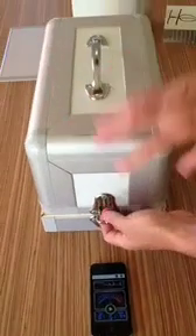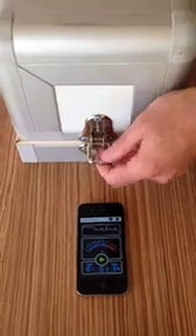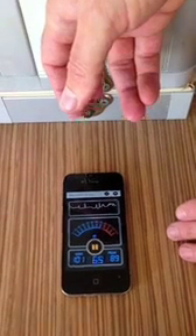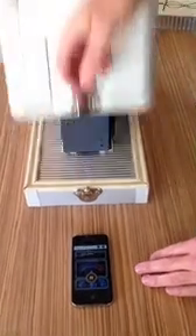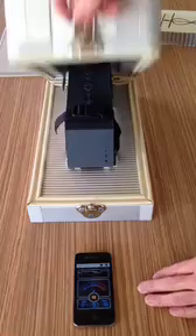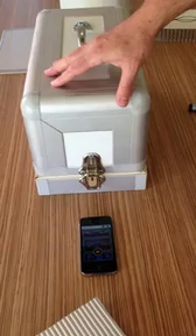Here's an example of a unit built using the standard extrusions. We'll use an engine control room noise as an example. You can see currently I'm looking at about 62 decibels when I'm not talking. Opening up the box, we're looking at around 93 decibels. So that's approximately a 30 decibel drop — the panel reduces about 28 to 30 decibels of noise.